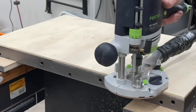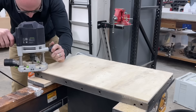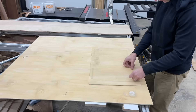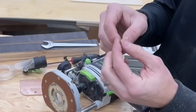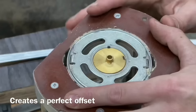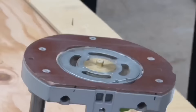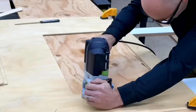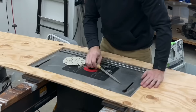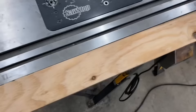This is the first time I've done a large-scale inlay like this. I'm going to create a template of my router table, put that on another piece of plywood, and reverse the template with a White Side inlay kit to get a perfectly snug fit for dropping the router table into my outfeed table. The kit comes with an eighth-inch spiral bit and a bushing with a removable piece — you make your first cut with that, then add the spacer and make your second cut.